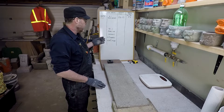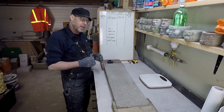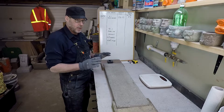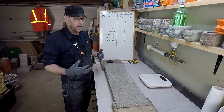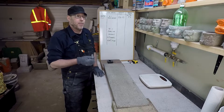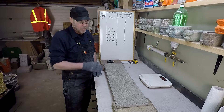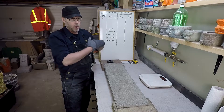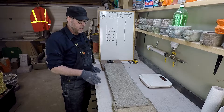In this case, this has fiberglass and PVA. I would expect this to perform better than a similar mix that doesn't contain those admixtures — specifically, they're put in there to increase strength characteristics. PVA is essentially glue, and 25% of the liquid we used to make this mix was comprised of PVA. We just took out 25% of the water and replaced it with this glue. It should make it stronger — I expect to see that.